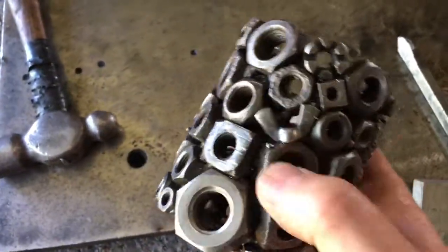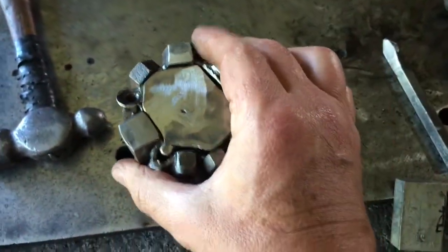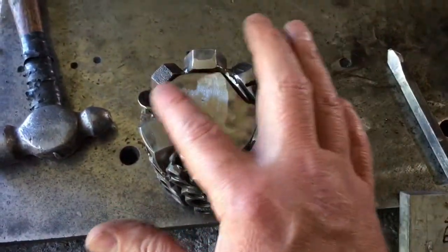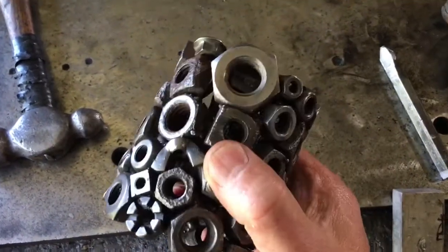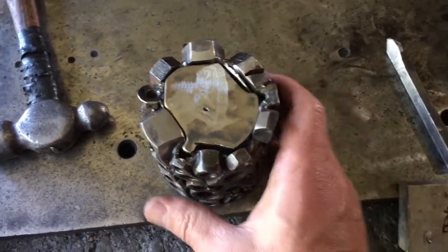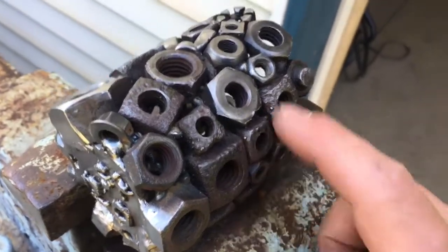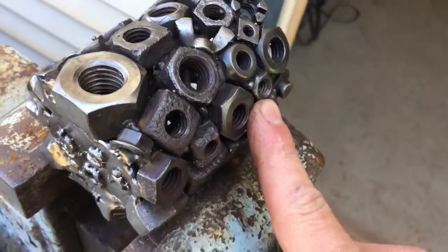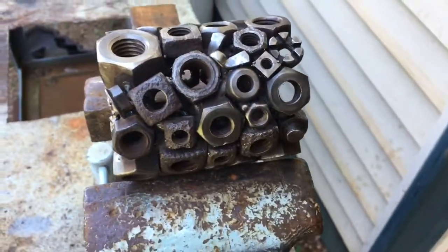So that's what it's looking like — there's the wing nut. I've knocked off some of the bigger weld globs and I've made this plate. I think it's 3/16th material — it's actually a drop from a hole saw when I cut a hole in a bumper. I welded in the center hole and conformed it so the ink pens don't get wedged down in the corner. Tapped it in and it fits pretty good. I need to weld this in and then clean up all the little weld BBs. Got that welded in, got my signature on there.